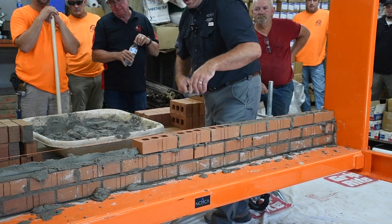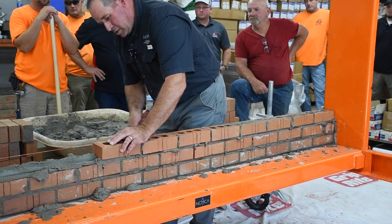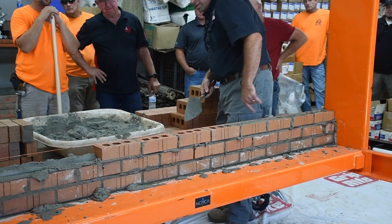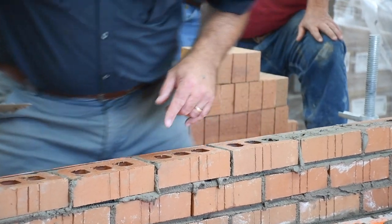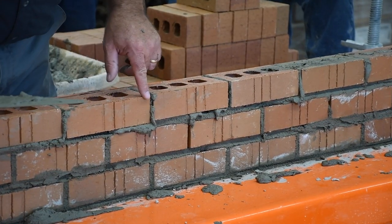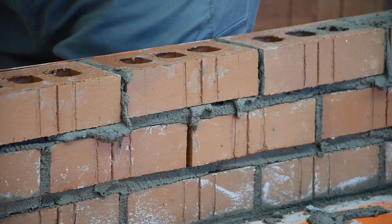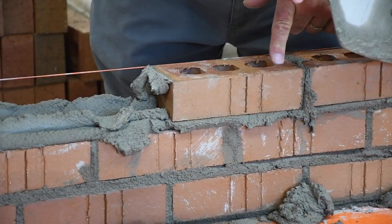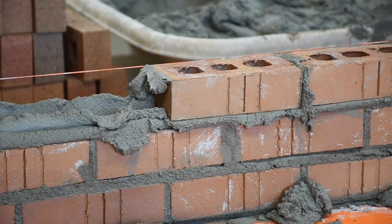If I'm looking at that brick — everybody see that? What did it look like over here? We're close. Making sure when I lay that next brick, I pull it in — look what happened to that mortar. So there are multiple techniques you can use on the job to achieve that full joint.